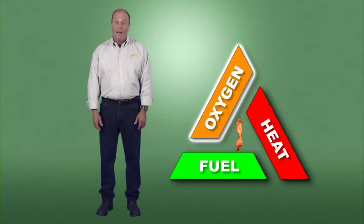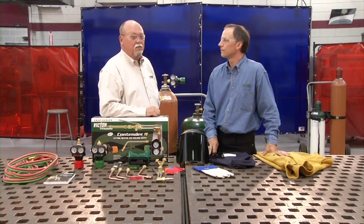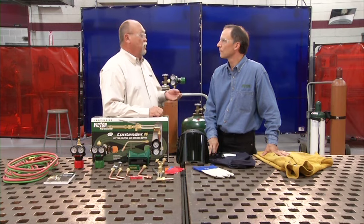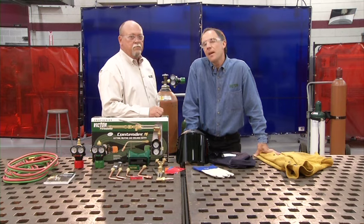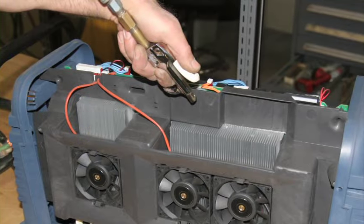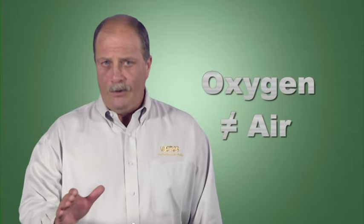Remember the triangle of combustion — oxygen is one of the components. Oxygen comes in many containers: compressed cylinders, a bundle called a bank or six-pack or twelve-pack, liquid oxygen containers, pipelines, tube trailers, and large bulk tanks. The biggest mistake is to use oxygen in place of compressed air — you never want to do this because it could create a fire hazard. Areas where oxygen gets misused most often include using it with pneumatic tools, blowing dust off clothing or a work area, or using it as ventilation in place of air. Never, ever use oxygen in place of air.